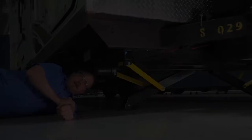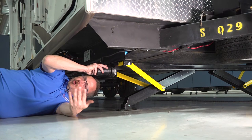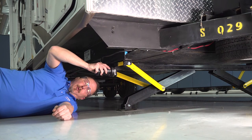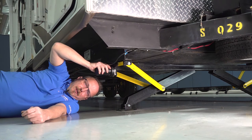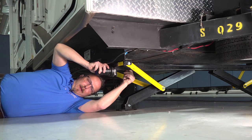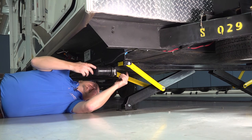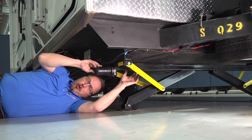Let's talk about maintenance of the PSX-1. Maintenance is simple. Electrically, make sure your battery terminals are clean and that you have a fully charged deep-cycle battery. Also make sure the leads don't have any corrosion — if the jack stops working, immediately check those connections. As long as you use a weatherproof connector you should be in good shape. Keep the jack itself clean of dirt and debris. There is a worm gear that runs along the length of the PSX-1 — wipe it off, clean it, and give it a light dusting of lithium spray, then wipe off any extra residue. You don't want to saturate it, just a light coating. That helps prolong the life of the PSX-1.